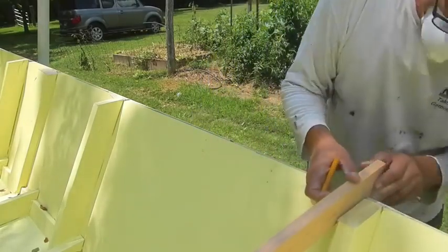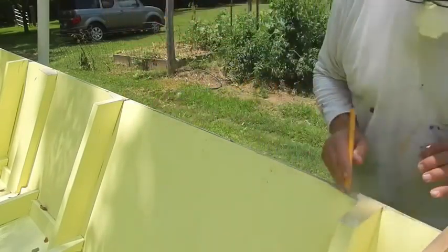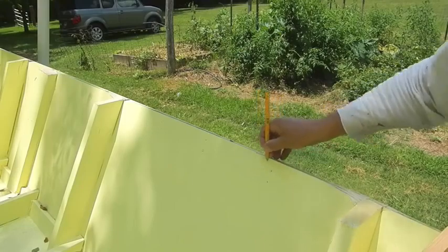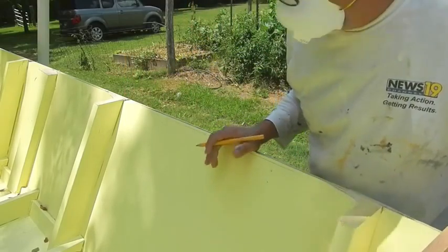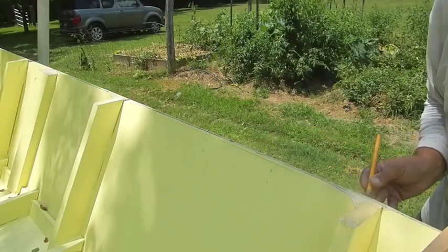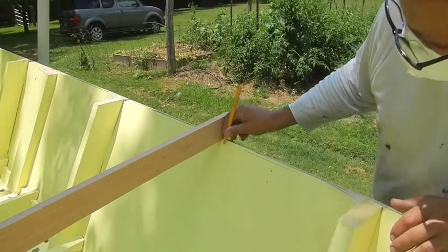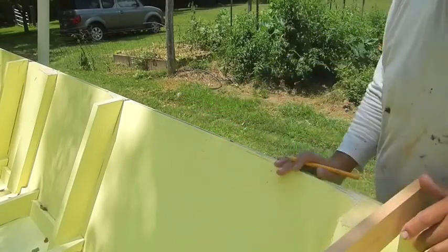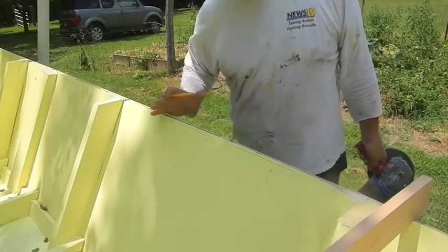I'll take a board and lay it on there from the other side — looks pretty good. I did the same here. I know I'm at about three-eighths just by looking at it, so I could take my pencil, give myself a rough line for three-eighths, and grind all this off. My outside line is going to be even with the outside of the rub rail, so I'll just taper that off and check it as I go. We'll give the three-eighths line a shot and then adjust since I don't have an even plane — I have to step back and eyeball it to make sure I'm staying straight.